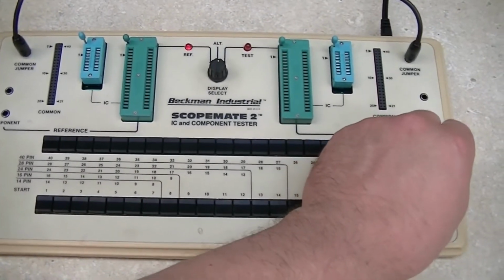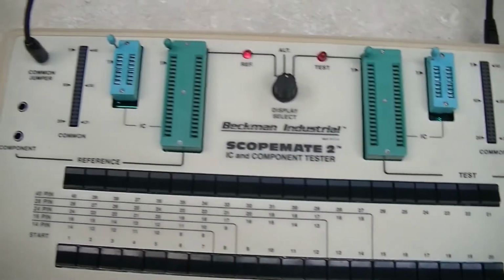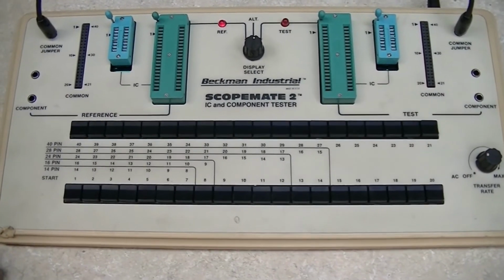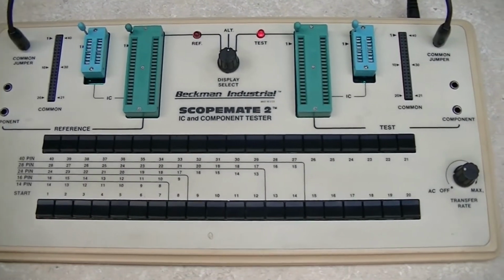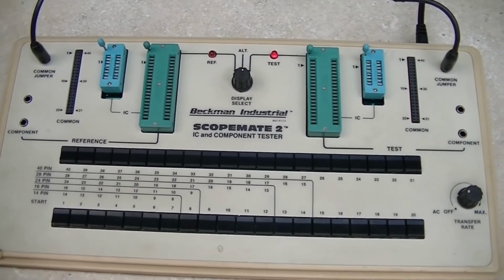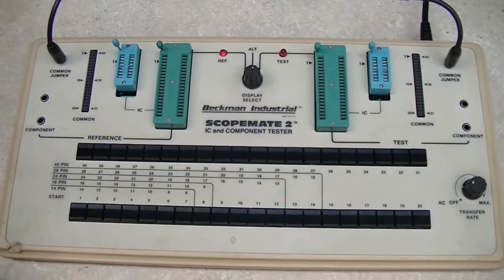It definitely runs the alternating display. So I'm going to try it with the 10 volts and see if everything works. Check all these switches, see if they're noisy or even functional for that matter. I suppose I could have flipped the thing over with a multimeter and checked every one, but it'd be easier just to do it with a component in the circuit. So I'll get the Beckman 9020 oscilloscope out, have those all hooked up, and we'll test a couple components and see what happens.